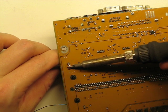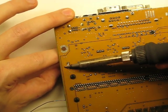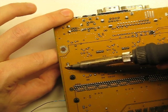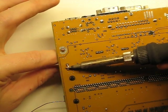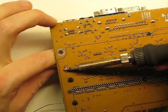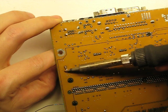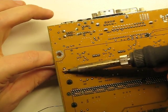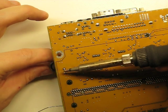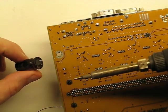And there's the bottom. I'm going to heat up the bottom. Now, this is the one that's connected to the ground plane. Another potential problem is that this could be connected to the outer part of the foil on the capacitor, so the capacitor will start getting really hot. Make sure you keep this gentle. This should be mainly a pulling down motion. And off we go.